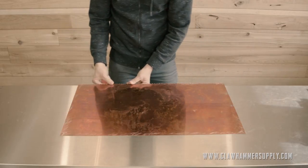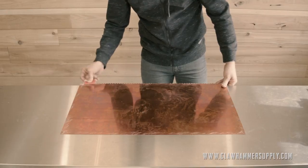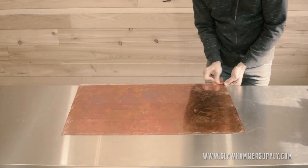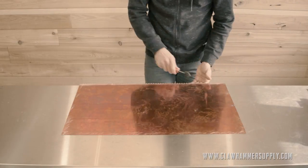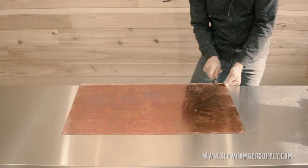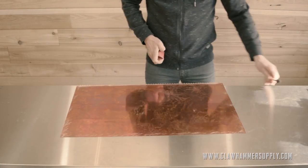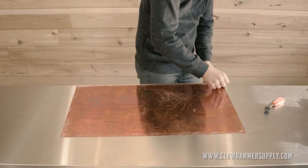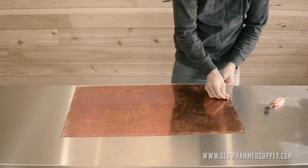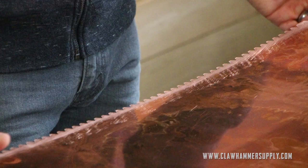Alright, the next step will be to remove any oxidation from the edges that will get soldered together, which is what I'm doing here. We'll just hit it again with the sandpaper, but this time I'm concentrating on the flat surface of the copper and not the edge. It's a bit easier to clean the teeth of the still boiler with the wire brush, which is what I'm doing here. I like to clean about a half an inch to an inch of all the edges. You don't have to go crazy — all you really need to do is just scratch the copper up a bit.